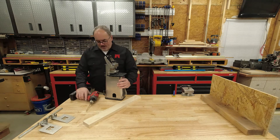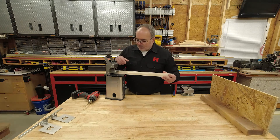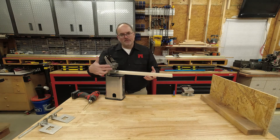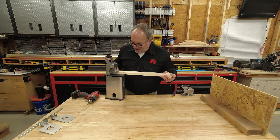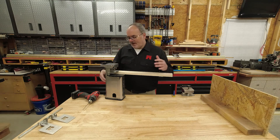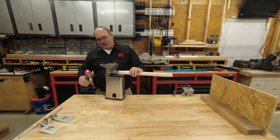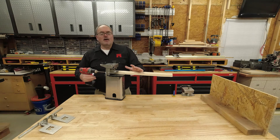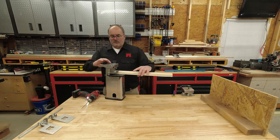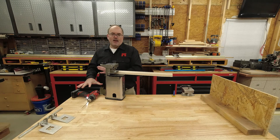This area here is for our drill. The way the machine works — there's a router bit that comes out of the table, you'll see that in the 110 overview video. If I clamp it down, I pull down from the pocket lever, I cut the pocket, I grab my drill, go into the drill guide, and I drill the pilot hole. This whole motion right here is super simple if you've got everything in this particular position.